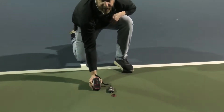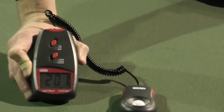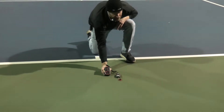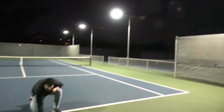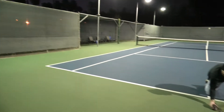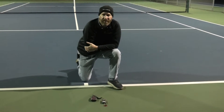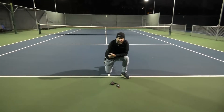We want to show you some meter readings on the old court here with the eight metal halides on it. We're up around 200 lux right on the baseline, straight between two lights, so we should have pretty good lighting right in the middle — only about 20 foot candles, a little bit less than that based on this lux. So we are not very great for sport lighting at this level. Usually 20 is a minimum on most courts and fields, but we typically prefer to see 30-plus foot candles.